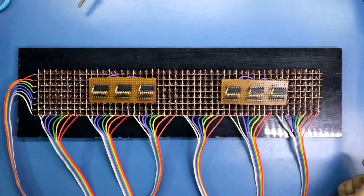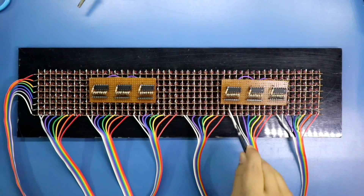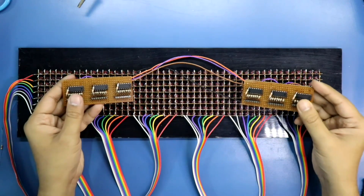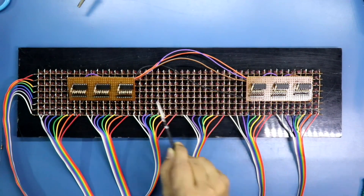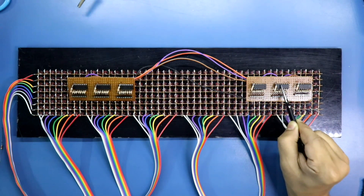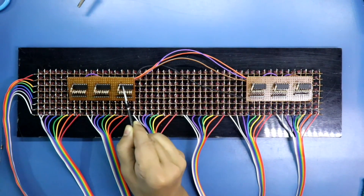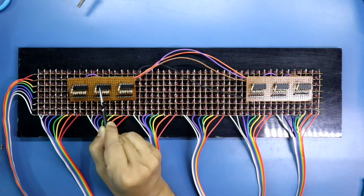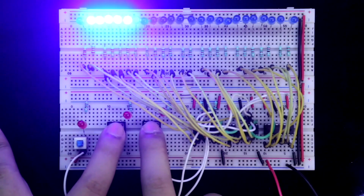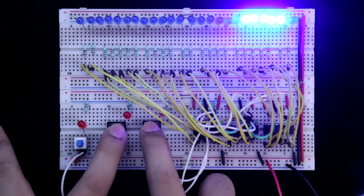Now see here carefully. We have to connect all pin number 12 together and pin number 11 together. After that we have to connect the positives and negatives. Pin numbers 11 and 12 and positive/negatives are connected. Pin number 14 of IC1 will be connected to the Arduino. Pin number 9 of IC1 goes to pin 14 of IC2, then IC2's pin 9 goes to IC3's pin 14, and so on to cascade all 6 ICs. I already uploaded a video on how to cascade the IC 74595 — please follow the link in the description.